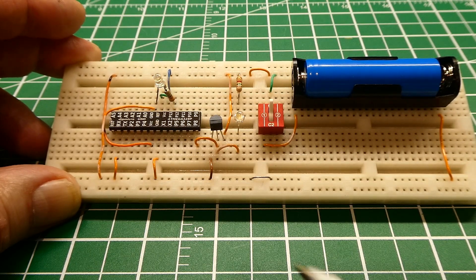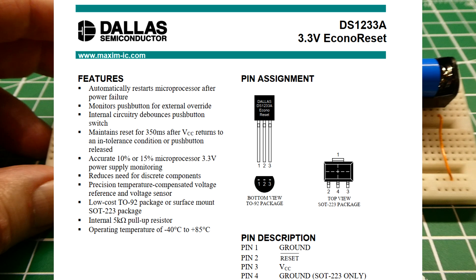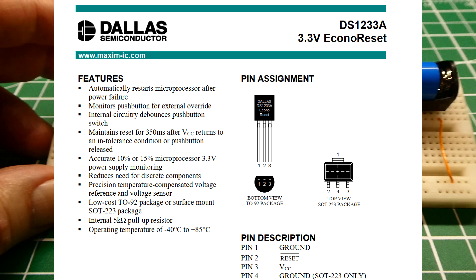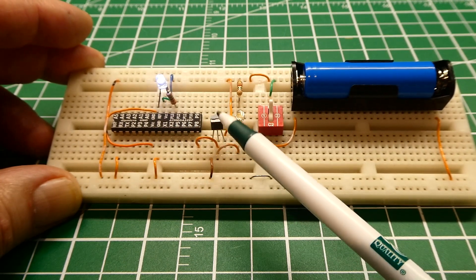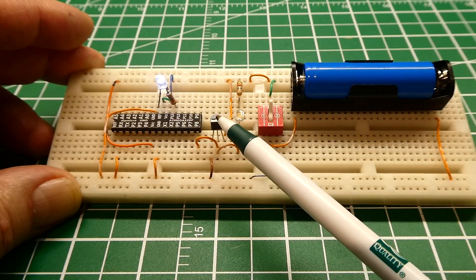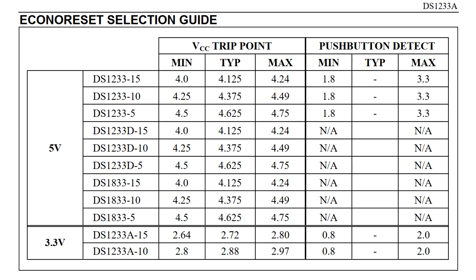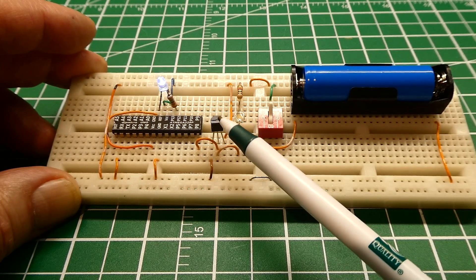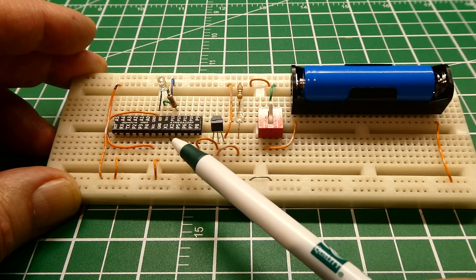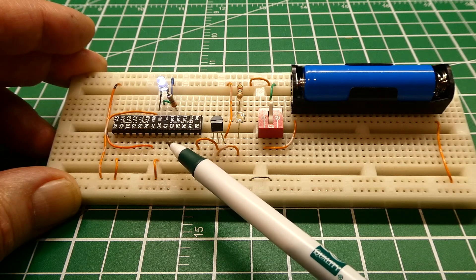What I've done is gone to this component — a one-component solution. This is a DS1233A, a 3.3 volt econo reset chip. Back in the days of microprocessors, the reset circuitries weren't very good, so Dallas Semiconductors came out with this chip. It will reset the microcontroller or microprocessor if the voltage drops down to 2.88 volts, as you can see in the chart. I've hooked it up so that if it senses the voltage dropping to 2.88 volts, it will pull a GPIO pin low, indicating a low battery alarm.